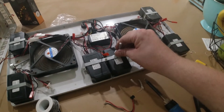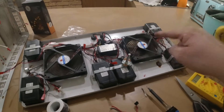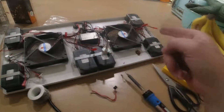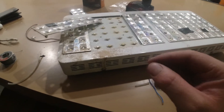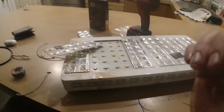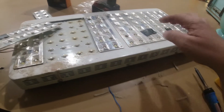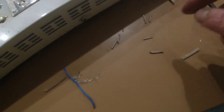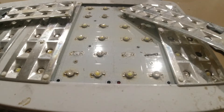Alright guys, it turns out these aren't a huge loss — I can actually put the failed variable resistors on the fans to turn them down a bit, since we're only running one bank of light and it doesn't need the full cooling. It will also make it quieter. Things have escalated since I got the two banks working — I sat it on the tank and it was very, very red, so I got some tape and put it over some of the red LEDs until I got the color I liked. But it melted the tape, so now I'm deleting six red LEDs and I've got six little wire bridges to solder on.